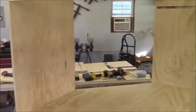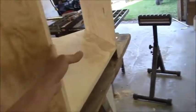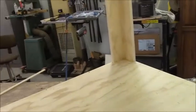And don't ask me to make another one. This is a corner sink kitchen cabinet. It works out to be 45 inches deep each way. Of course, 24 inches here for your end cabinets coming up against it. This end's going to have a drawer cabinet coming up against it. Two doors in the front, no stile, so you can open it up and get right in here.